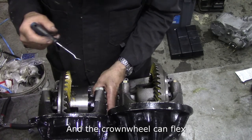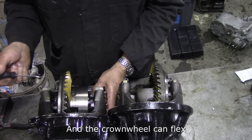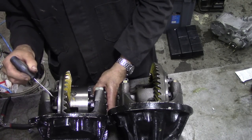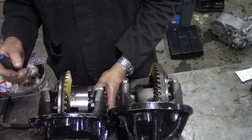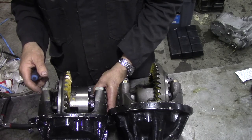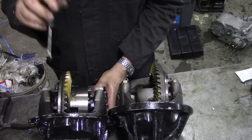What that means is the support is very much the same, but the crown wheels are very thin. And that means the bolts haven't really got a great deal of contact going through them. When we stripped down that Puma one last year, we found all the bolt heads had snapped off, but the bolts were finger tight. Now, had somebody been messing about in that before? We don't know, but it seems to be quite common.